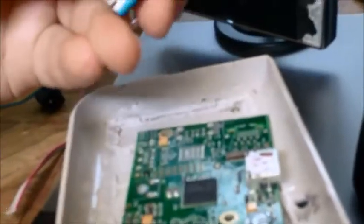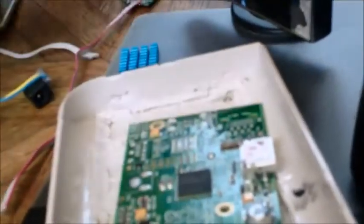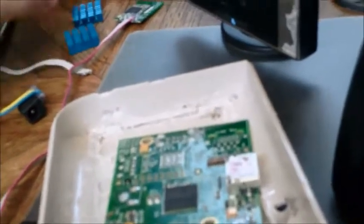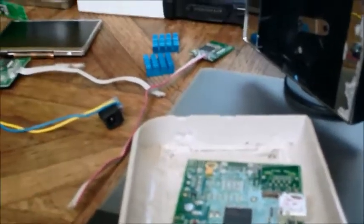There was no space for the adapter over here. I do want to run this thing in maximum overclock mode, so I got this heatsink. I used my Dremel to cut out the pieces that would otherwise interfere with a couple of the SMD components. I'm not a fan of what they call frag tape — the double-sticky tape that this normally comes with. I'd much rather use something called Arctic Alumina thermal epoxy made by Arctic Silver.